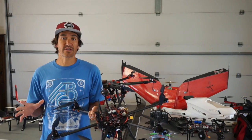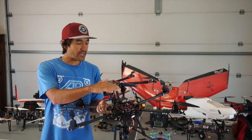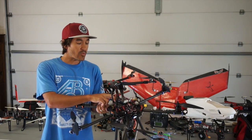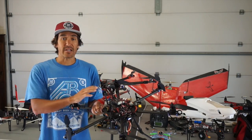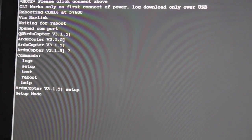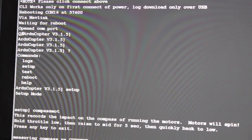Once the calibration is done, you always need to be concerned about any sort of interference coming off of each of these ESCs. Run the compass mot command, see what your interference is like, and you can always use a GPS antenna mask — I actually designed and 3D printed it, it's on Thingiverse, I'll post a link below. Compass mot is a nifty command line utility in Mission Planner that will log your ESC interference.